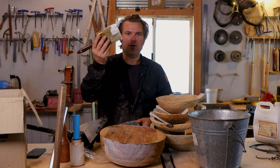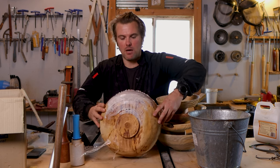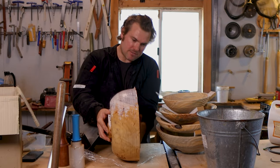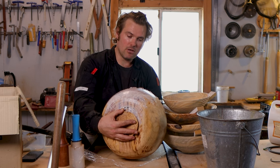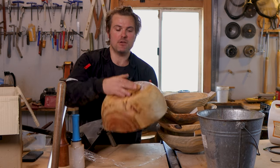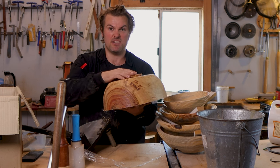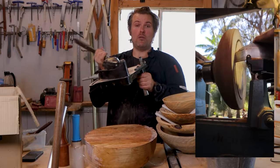Don't thin it down with water. If it's super thick and quite gluey, just add a little bit of water to make it easier to get it on your brush — this is just a $6 fencing brush. How I apply it to the timber is by painting on the end grain only. The tree grew up like this; we've cut it with the chainsaw, sliced it down the center, turned the circle, put it on the lathe, turned the back, and formed the tenon. You paint it on the end grain only on both sides. I even put a little bit on the tenon as well.